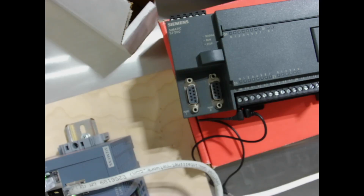That works. It might be a bit slower depending on what's going on, because depending on how many bytes or devices you have and how many people are actively sending information out, there's a lot of information that could be there. So that could be a bit on the slower side. We do have also a master and slave system. So the master obviously would be the control bus. So that'd be the main control. Nice thing here is we can have multiple masters.